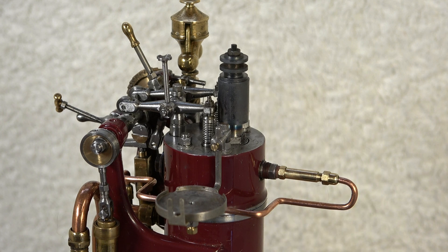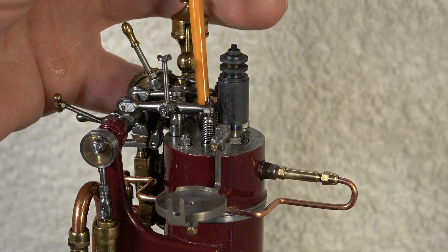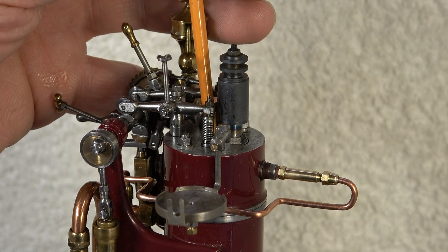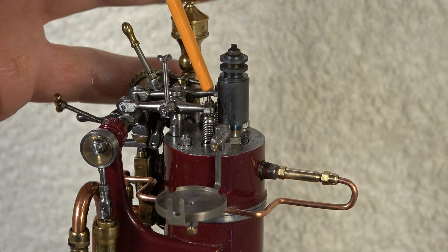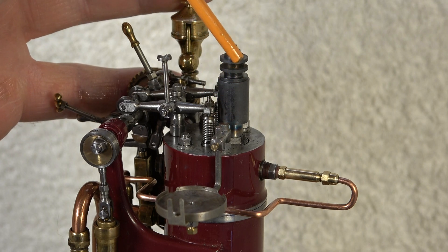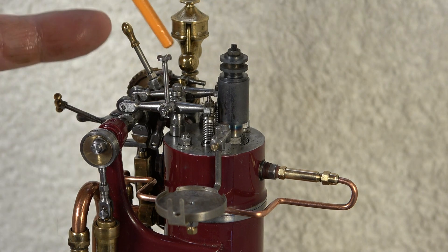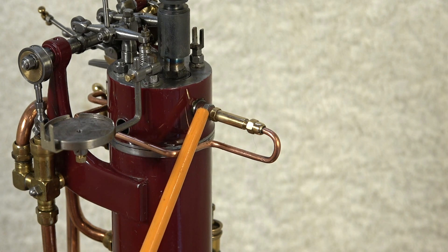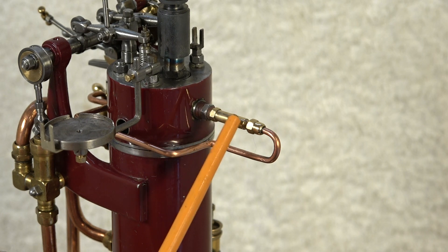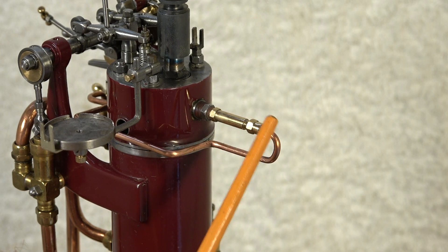When the engine was running as a true diesel, the combustion chamber was situated in the middle of the cylinder head. But I had to move the combustion chamber from the middle to the side, in line with the hot bulb, to have the hot bulb and hot bulb cover free of the rocker arms. I had to drill and tap a hole in the cylinder head for a new injector and make a new pipe connection from the injection pump to the injector.